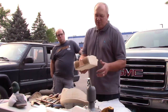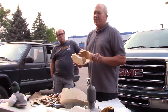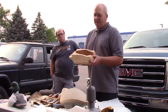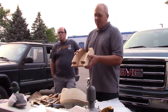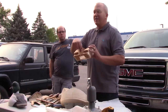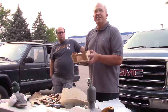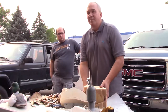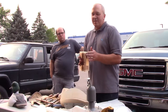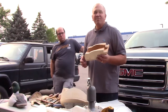One thing too, I just want to show this quickly. I think Duck Blind, Willie McDonald, has a tutorial on their website with this, and this is what we used when we cut out a bunch of bluewing teal for Dave Jacobs' kids project. It's some plywood sides, with one decoy on the top, then they slide in like this, and you don't have to fit in a bandsaw like this. You just cut all of this to there without cutting your plywood, and you can cut out a bunch of them very quickly.